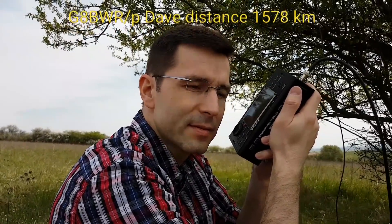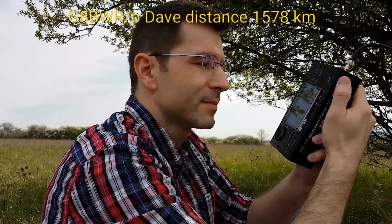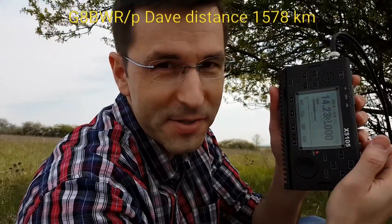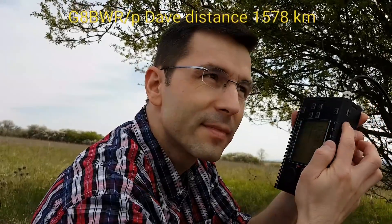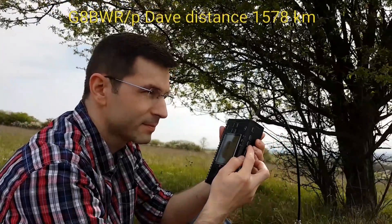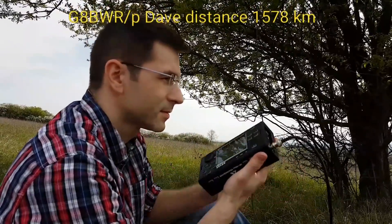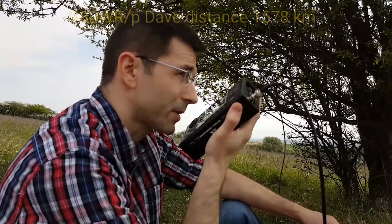From Golf 8 Bravo Whiskey Radio portable — Oscar Mike Zero Echo Tango — copy, Paul. You're doing very well on that 5 watts on that handheld with just a whip. 5 by 5 signal report to England — 5 by 5, which is off the ground with our vertical, but it's a modified CB 5/8 waveband, and we have an auto-tuner. It does work on several bands. Anyway, 73s Paul, thank you for our call, and good luck with your QRP station. Golf 8 Bravo Whiskey Radio portable to Oscar Mike Zero Echo Tango. 73s.